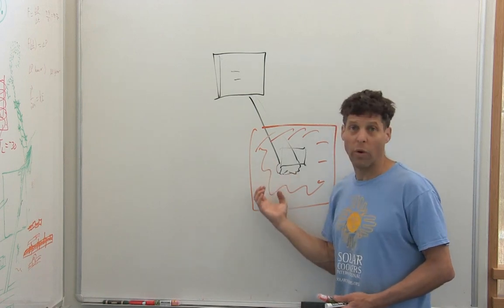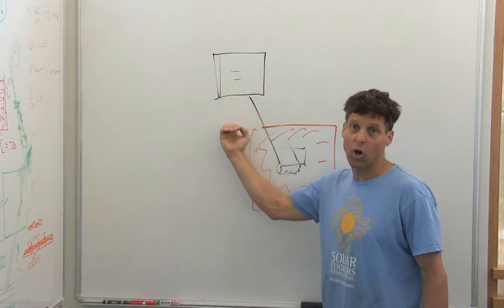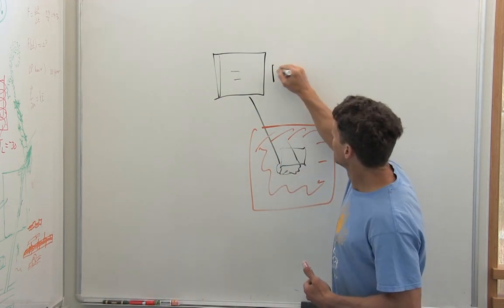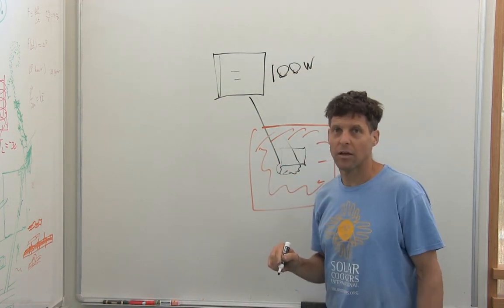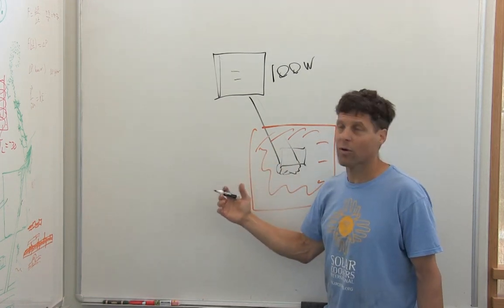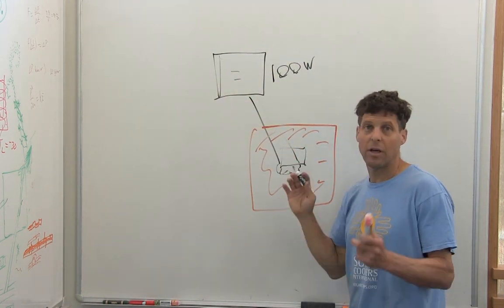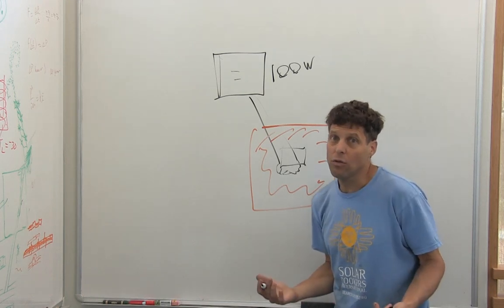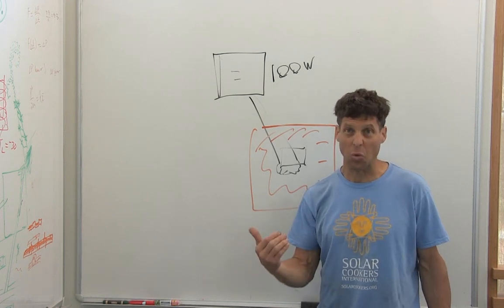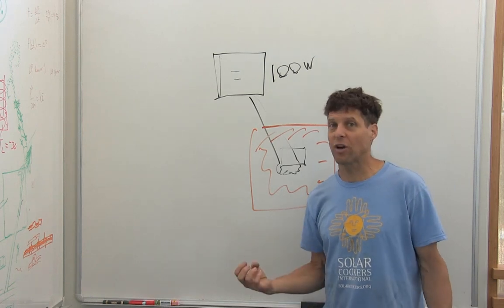However, some people don't want to cook in the day when the sun is shining. And in order to keep the costs low, we have a low power solar panel — in this case, 100 watts. This requires us to cook throughout the course of the day. So if you want more power, we need to store this 100 watts over a long period of time and dump it in a short period of time into the food. You can do this with a battery, but that requires an expensive battery which after about a year will go bad, with environmental consequences and the need to buy a new one. And you need charge controllers.